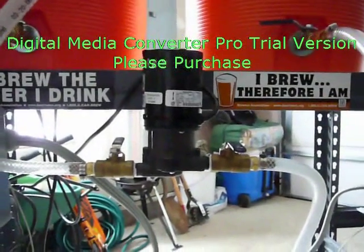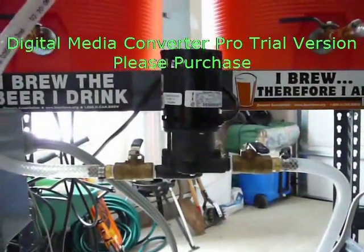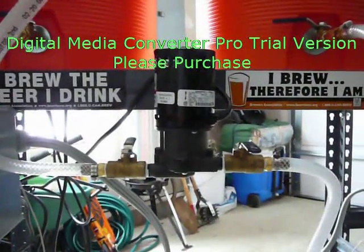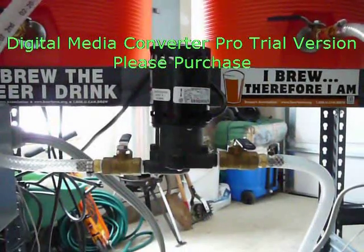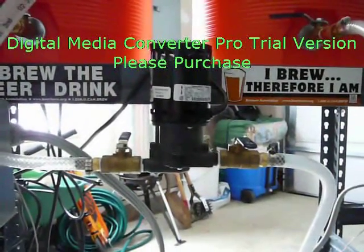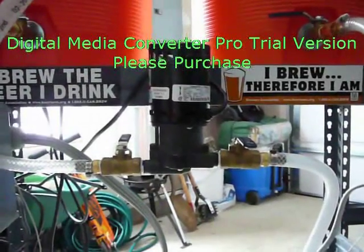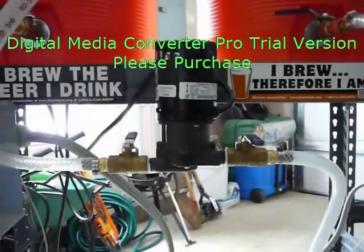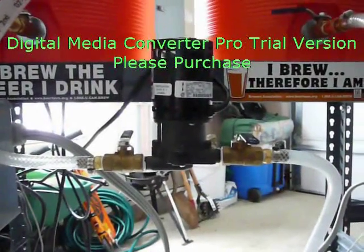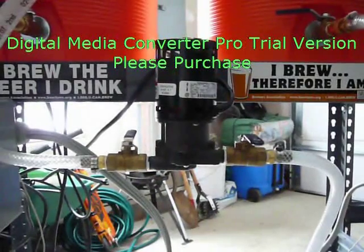Alright, here's the March 809 pump, used pretty much primarily by home brewers as their sole source of pumps for transferring hot fluids. Just a magnetic impeller, a high temperature pump. It's got the polysulfone head, not the stainless steel or the bronze. I've never had any problems with reliability on the polysulfone heads, even attaching the brass ball valves as you see there.